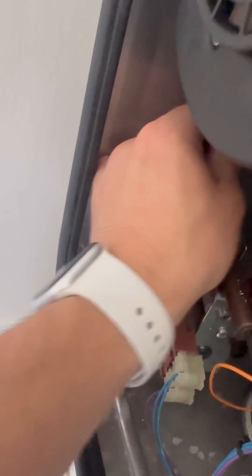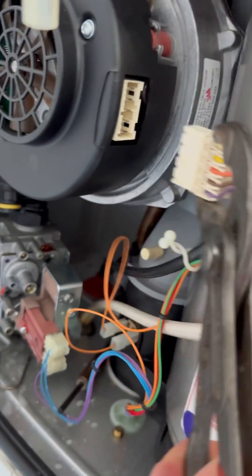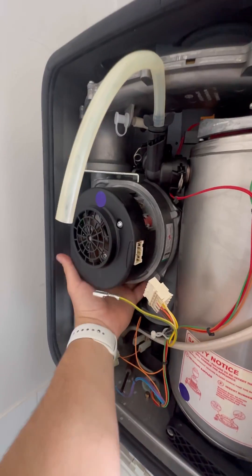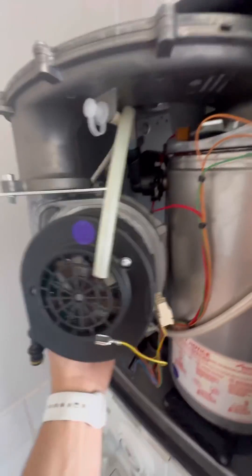I carry these as van stock, so just pop the pin out and give that a wiggle. Use your grips to disconnect the fan, then use a 13mm socket on the top to undo the nut. Twist the burner assembly out with one hand.